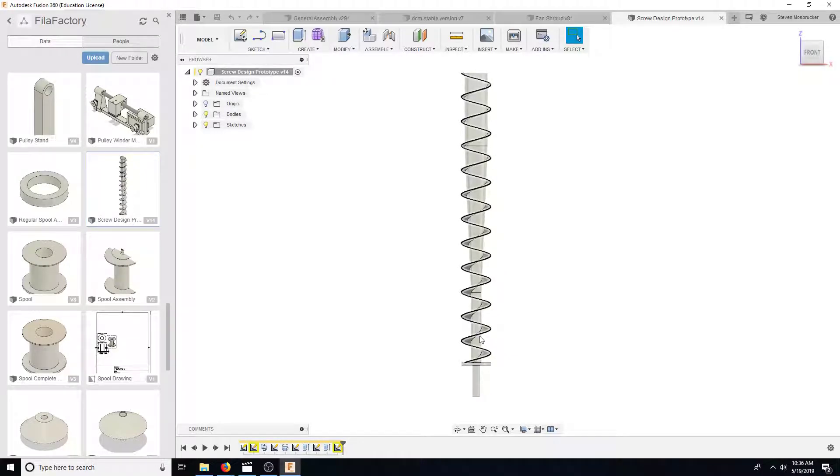As it gets to this point it has very high pressure, and this is just to make sure everything equalizes out and everything is melted. Over here is the hottest area of the machine — by the time it gets down here it's going to be so hot it wants to come out. Low pressure outside the barrel, high pressure inside, so the pellets take the quickest exit out. The screw is still being decided — I'm thinking about whether to decrease the screw size and barrel size. There are rule-of-thumb guidelines online about different screw parameters.